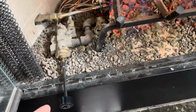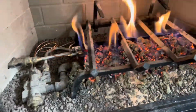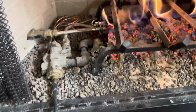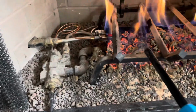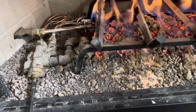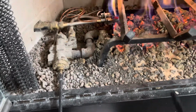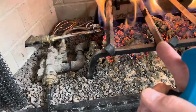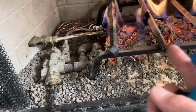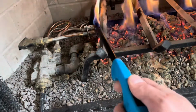And I'm gonna show you guys a quick tip that I just learned right now, and I never really knew this. So when you turn your gas on over here, and you go over here to light your pilot, so you got this turned on, and you got your flame by it, it should be blowing air out because there's air inside of the line. What you wanna do is get rid of all that air, and the way to do it is to hold this down and put the flame by it, or you could put your finger by it and see if it's actually blowing out. Because if you don't get that air out, that's why when you're going here to light this thing, it's actually not lighting.